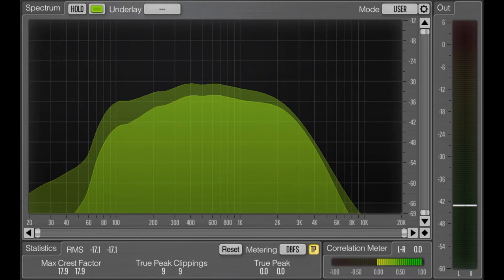I'm gonna go ahead and play the guitar with no capacitor in it, so that you have an idea of what it sounds like without any modifications. Then I'm going to solder a capacitor starting at a higher value, working my way down. And what that should do is it should slowly, as we go down in value, roll off more of the low frequencies. Now, I also suspect it's going to kind of weaken the signal altogether.